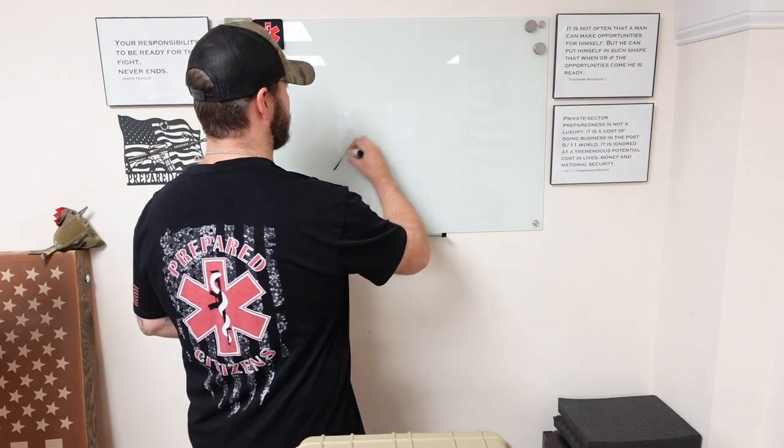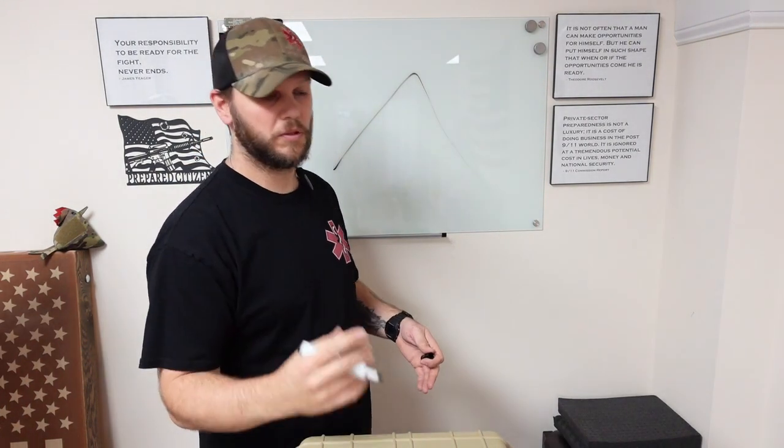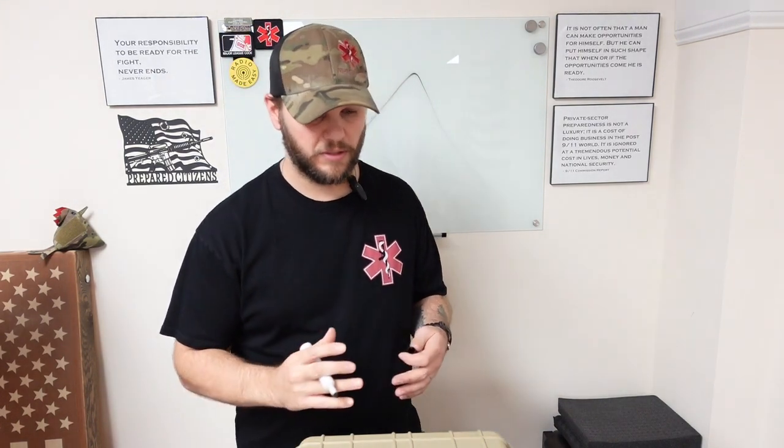So, two reasons you're going to want a repeater. Number one is going to be distance. Distance is a simple one because let's just say with our given terrain and radios, we're getting a mile. I'm just throwing a number out there. Let's say it's some pretty heavy terrain, we're getting about a mile in distance, being able to talk to each other and hear each other well. With a repeater, you can put the repeater at that 1 mile mark, and then your team members can go another mile beyond that, and you're still going to be able to talk to each other because all you have to hit now is that repeater between you, right?